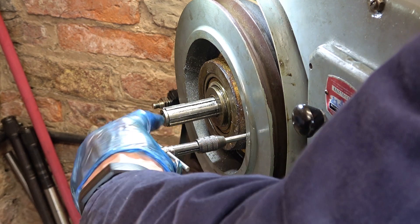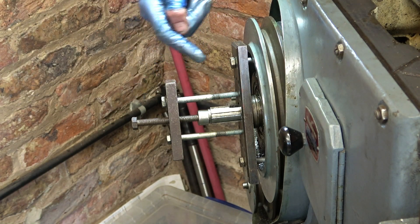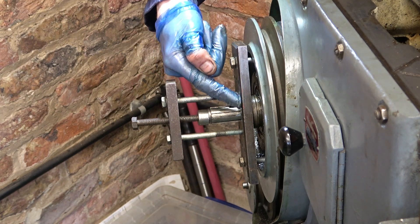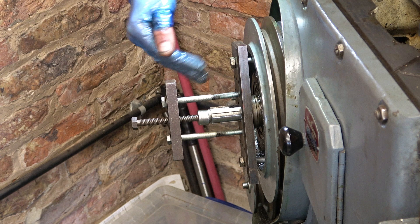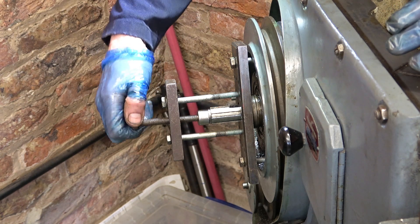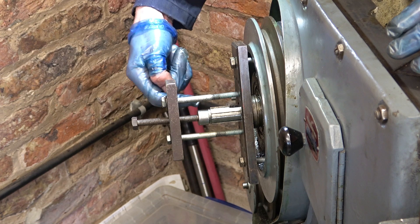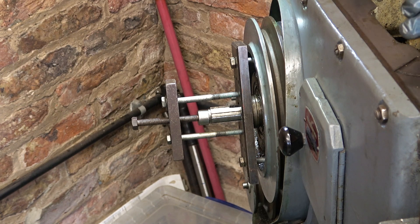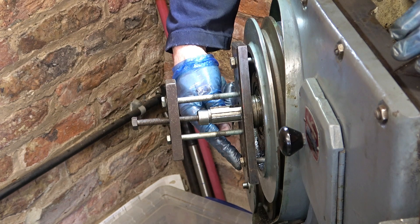It's going alright - it's going to work. After a bit of a struggle, I've finally got this puller set up to try and get this off. I've put a spacer behind this plate which pushes on the central boss that this thing spins on, and I'm hoping that will be enough. I've no idea how tight it's going to be. I prefer not to use this other bit if I can avoid it, because the same action that pulls the pulley off is also trying to push the shaft through, and the shaft could come out the other side.